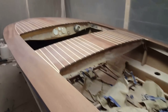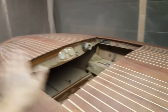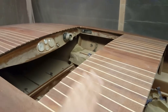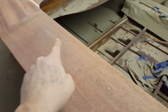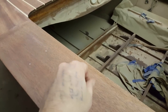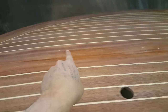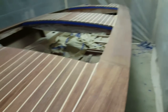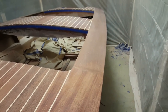Some lines had little shiny spots meaning they are still slightly below the deck, but I think with this third and final coat on everything it'll fill them enough that when it gets sanded and then cleared they should be flush. Every place where I put a screw - like here for the step pads - running over the top with that 220 flushed everything up. Here are my cleat holes, here is my bow light with the wire holes in the center. Everything's flush, sanded, wiped down with denatured alcohol, getting ready for the third and final coat.